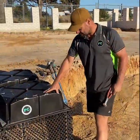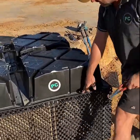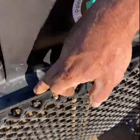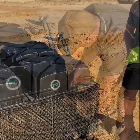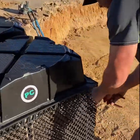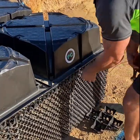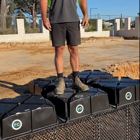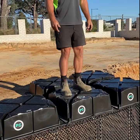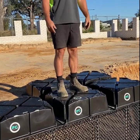As you can see, we've laid the biax on top of the drainage cell — sturdy as. The biax has got these holes in here; if you'd like to tie the actual drainage cell to the biax for extra support, you can do that. You can see the drainage cell with the biax slab system — neat, reliable, strong, safe. The main thing is safety. Jumping on it, it's not going anywhere — you can't do that on the pods.